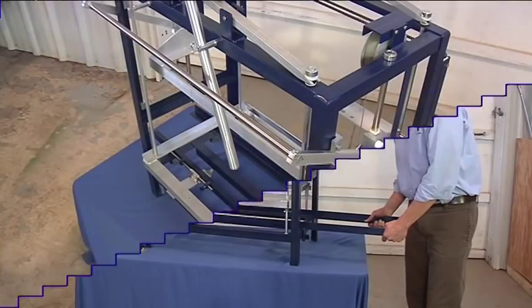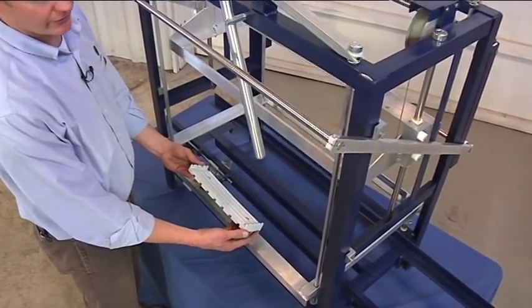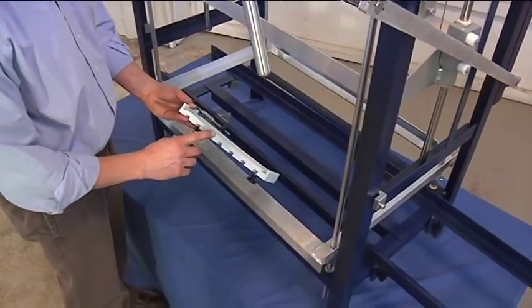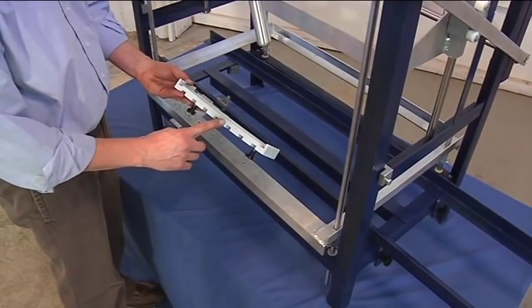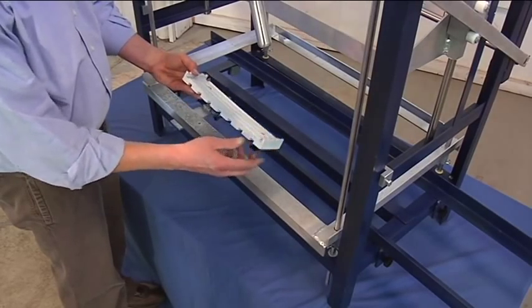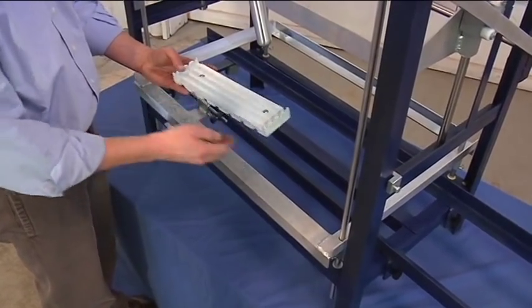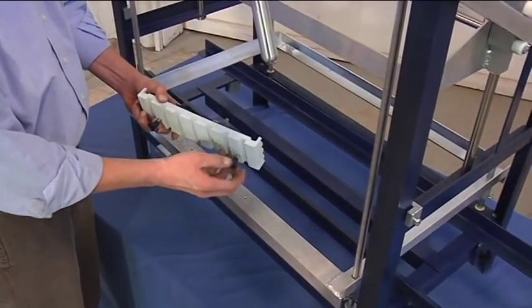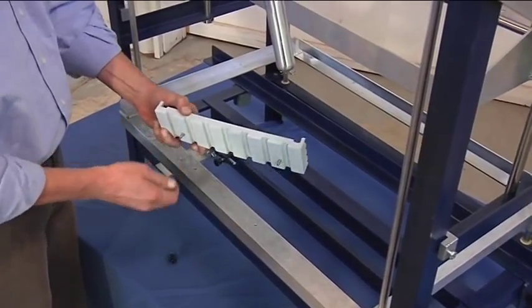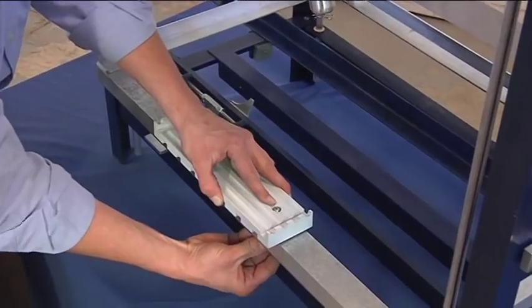Once you've placed them, please make sure that you still keep them loose so that there will be further adjustments in the future. Now we need to install the locator block onto the frame itself. Please make reference to the numbers that are on the front of the block itself. They need to be facing the operator. If unable to find the numbers, there's also a zero punched up in the lower left-hand corner. Please remove the thumb screws and install it directly onto the frame.